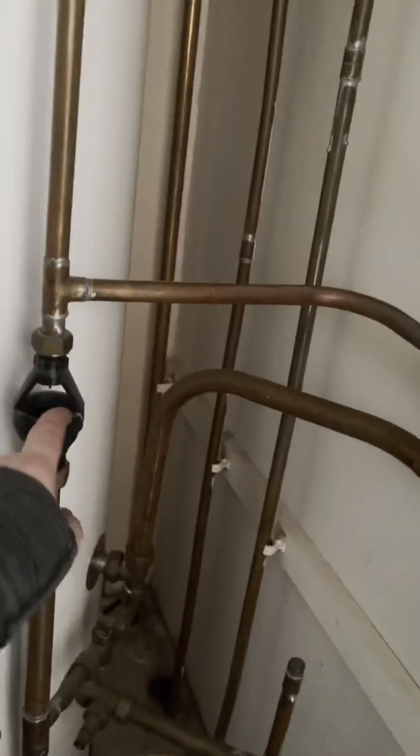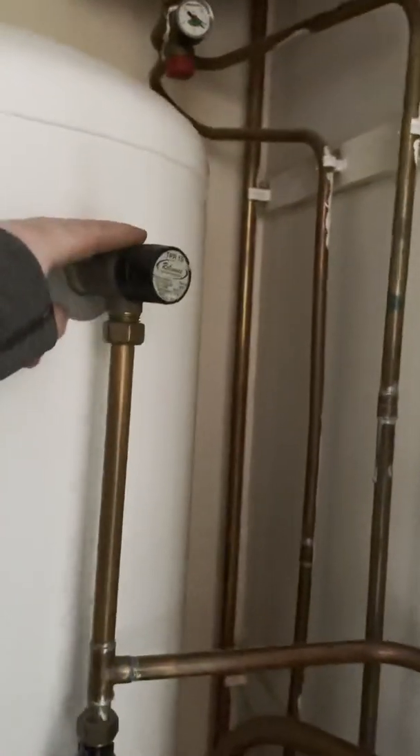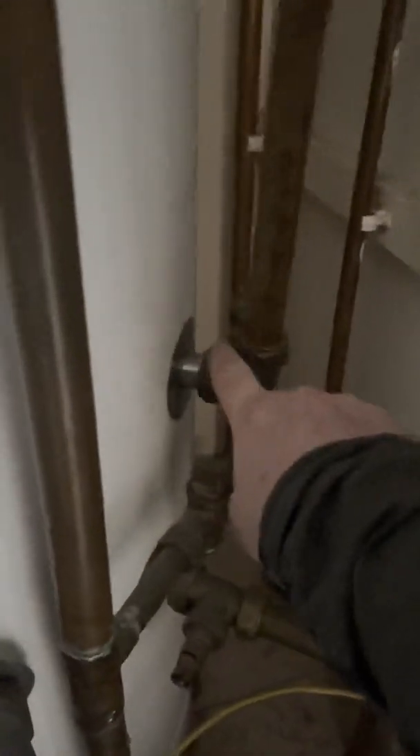Normally if it's cold and you feel the water it's cold here, it's this. And then if it's hot that'll be your temperature relief valve, which is this here. So we'll fold that on down to your elbow here, down and round, and then you'll have your cold inlet — your mains inlet — which will come in, fill the tank up from the bottom, then up to the top, and then up here is your hot outlet up on top of the tank.